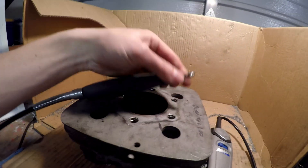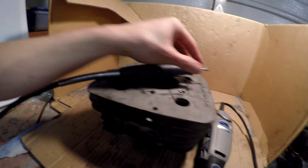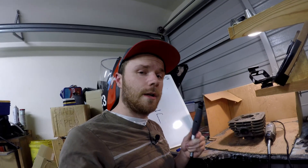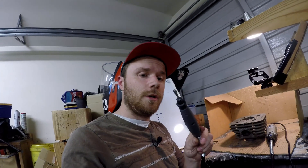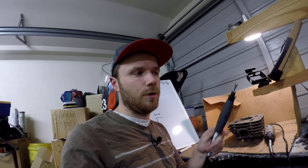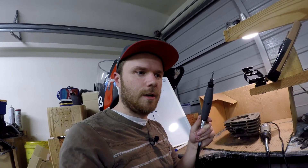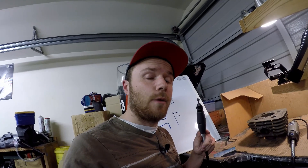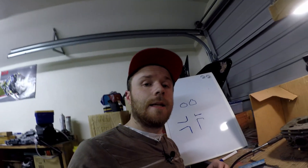What we're going to use to remove most of the material and do all the hard work is our die grinder — we've got a Dremel with a nice spherical burr on it, which will make it nice and smooth. Then we're going to go to a coarser sanding and then finer and finer until we polish it. The most important thing when using die grinders, which can remove a lot of material really fast, is to take your time, be smooth with nice flowing cuts, and try not to make any mistakes because you can't add material back.